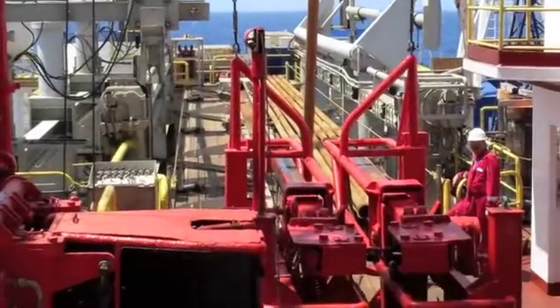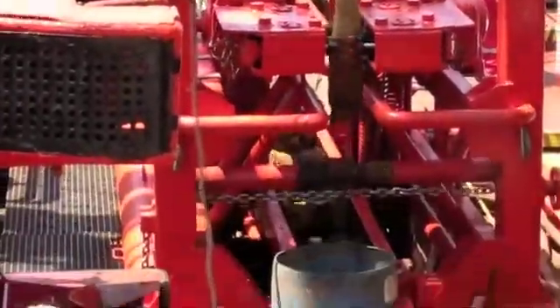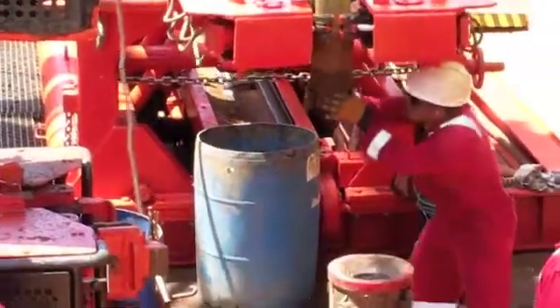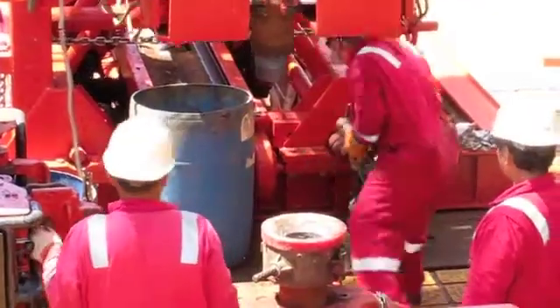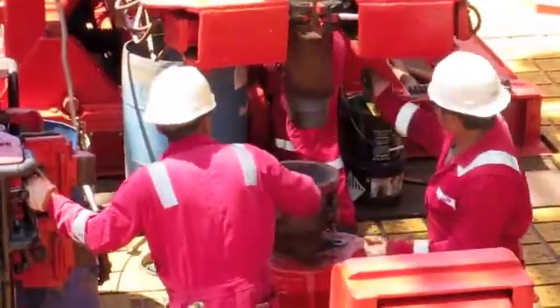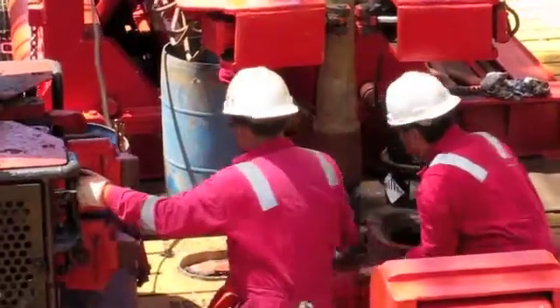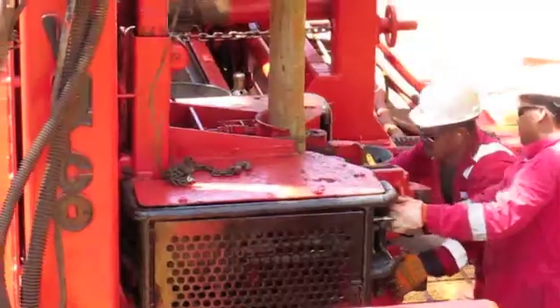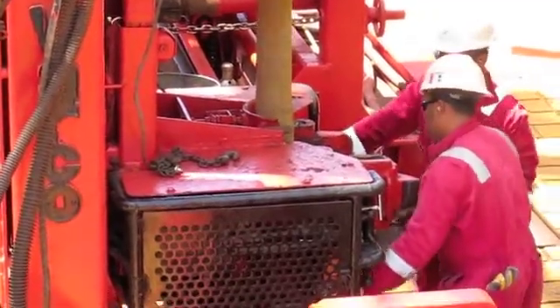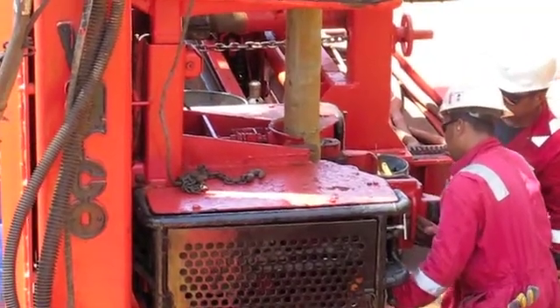As the other part of the pipe comes up from the pipe racker — back there is where all the drill string is — it comes up into the pipe stabber. There go Edwin and Louie on the right side, taking off a thread protector. They lower it down into a little connector that helps them get the threads and the pin together. The driller lowers it. The big red thing going around it is called the iron roughneck — instead of using large wrenches, we now use this instrument to screw the pipes together.